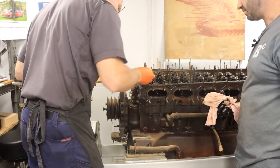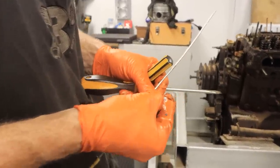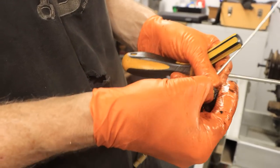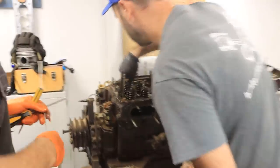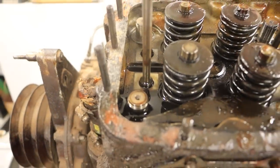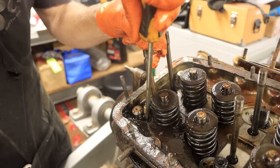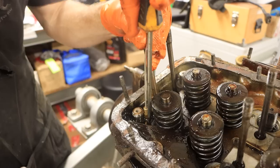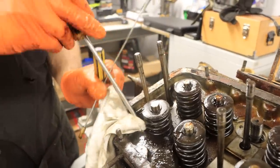This one's got a blind brass end cap. The four end nuts are like that, and they don't have the collars around the studs — there is a thin plate washer. Normally you don't screw directly down onto aluminium on solid heads, except for something like a GM LS engine with a flange bolt. On most aluminium heads you don't, and it's bitten into the aluminium through the pressure.